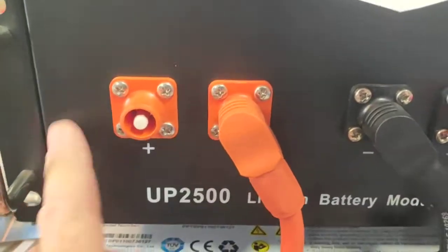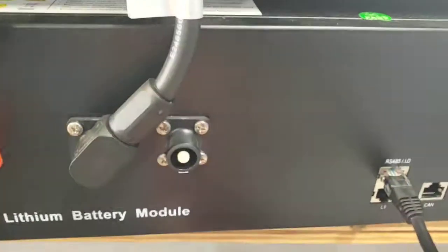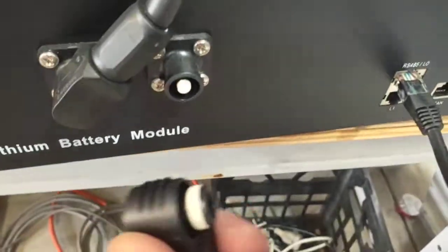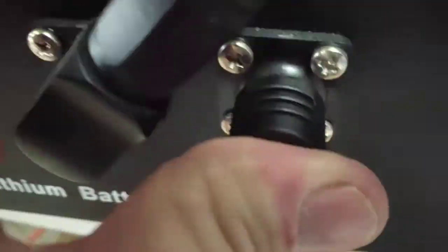What we're going to do is connect the positive on one battery and the negative of the other back to the breaker box. These two leads are pretty wide, obviously — there's a couple of meters of length on those. Negative on the bottom, but you can go either way as long as they're opposite.